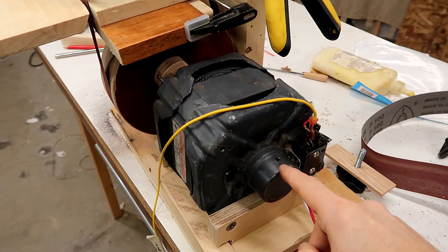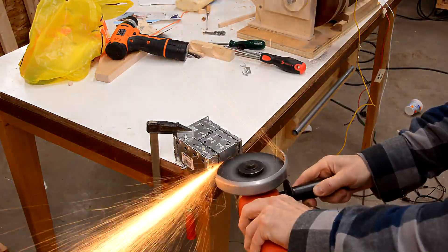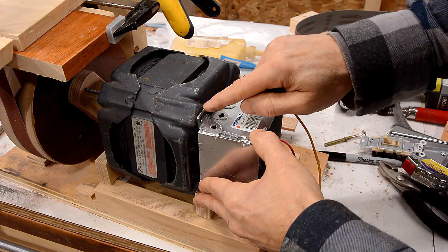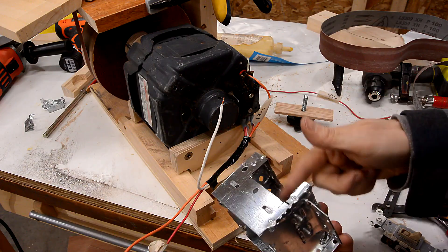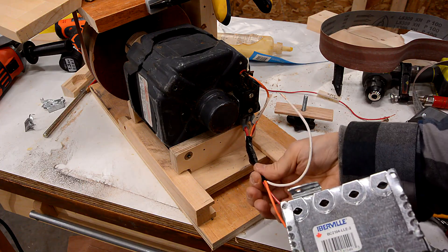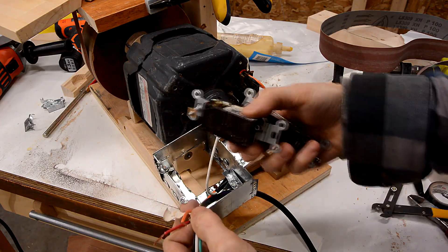In the meantime I'm going to add the electrical switch and I think I'll put it here. So I cut a big hole in here so I can fit this box snug on the back of the motor like this. I already made a mounting flange here, and I'll need some other way to attach the bottom. I used some of the rest of the material I cut out to make a mounting flange that goes on here, and that'll securely mount the motor. I wrapped some tape around the wires where they go through here so they're a bit protected, and a power cord goes through the other hole. Now I'm going to wire it up to these switches.